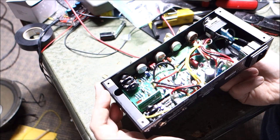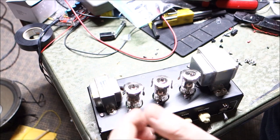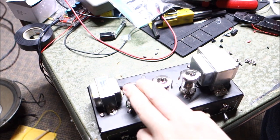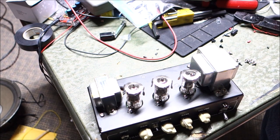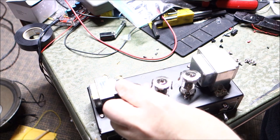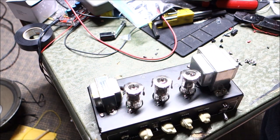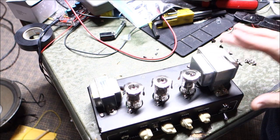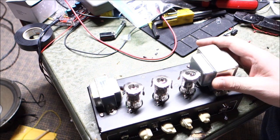This little thing is up to two watts into 16 ohms and about one and a half watts into 8 ohms. It uses all what we'd consider preamp tubes — there are two 12AX7s and a 12AU7, which they use as the power tube. Some people have swapped the 12AU7 for a 12BH7 and said they like that, but that makes the heater currents a little different and does increase the draw, working the transformer a little harder. Everyone who's done it says it's fine though.